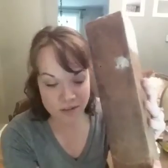All right, so here's the wood filler. Stuck it on there with my finger. I'm going to let it dry, and then I'm going to sand it off. I usually sand things flat with 220 grit and just go along until it's perfectly smooth. Sometimes you have to do 2 coats of wood filler to fill in all the gaps, okay?